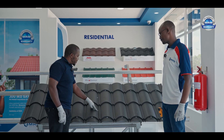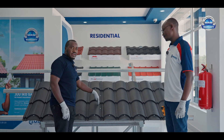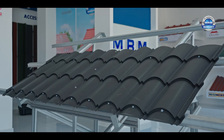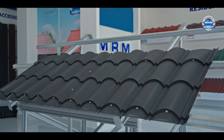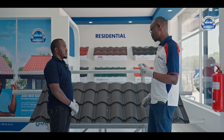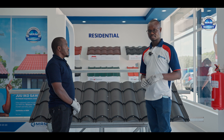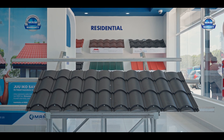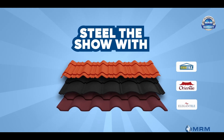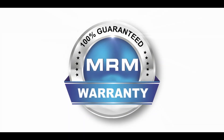After doing your stitching screws, ensure the sheets are well attached to each other and you don't expect any leakages. Your roof is 100% — and this is your roof for the Oriental sheets. At MRM, we are open; we do estimates for our customers. You can send us your drawing and we'll give you the number of sheets required, your ridges, flashings, valleys, and also an estimate of the screws. Steal the show with Versatile, Oriental, and Elegant steel roofing tiles — backed by a genuine warranty only from Mabati Rolling Mills.